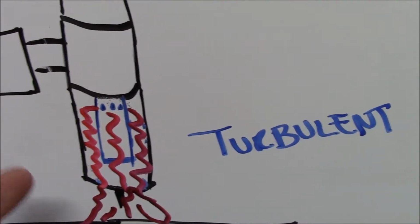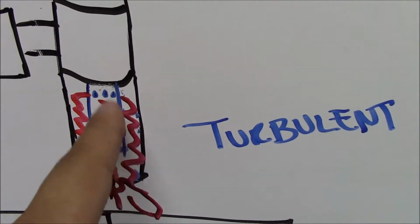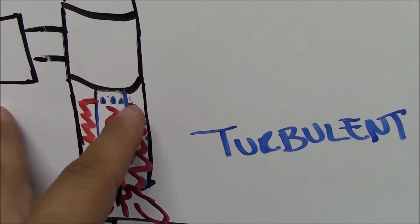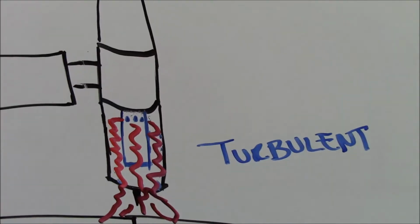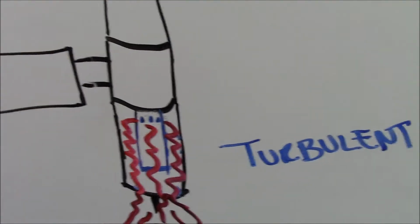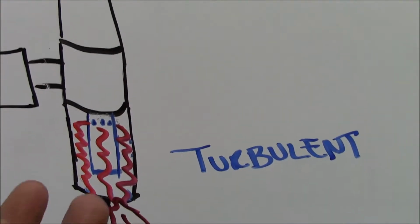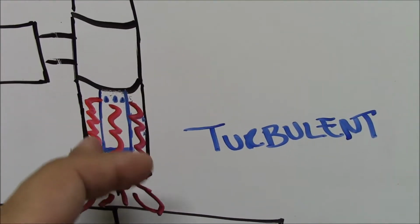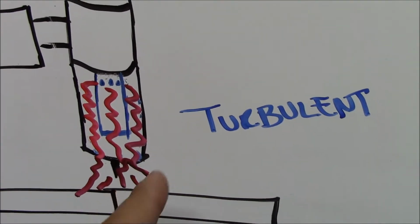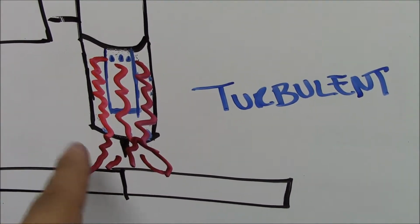a traditional gas diffuser is, we've got the diffuser screws into the torch body, or the head, and it's got these ports drilled into it, and that's where the gas will come out of. Gas comes in through the hose and will come out of these ports. And when it comes out, it's kind of turbulent, it's bouncing all over the place, trying to just work its way out. And then when it comes down to your workpiece here, it's still turbulent, it's just bouncing around.